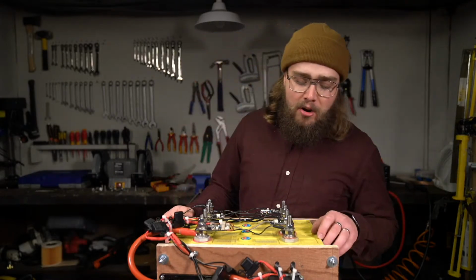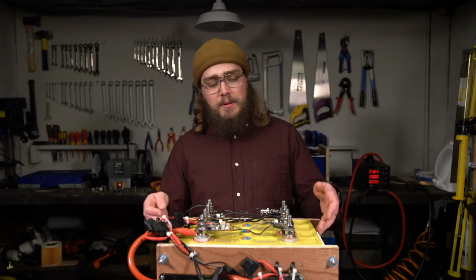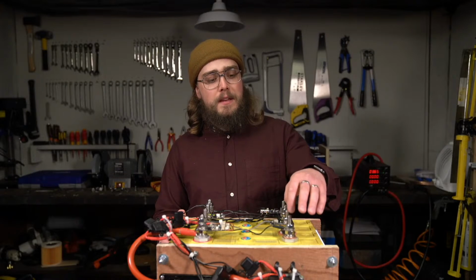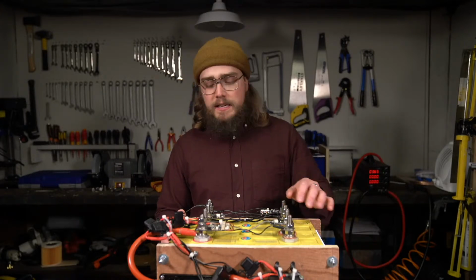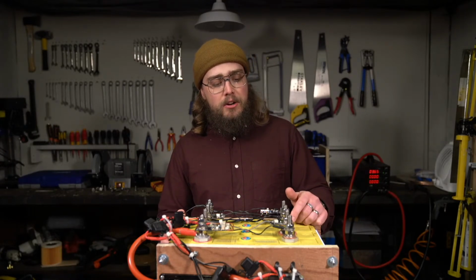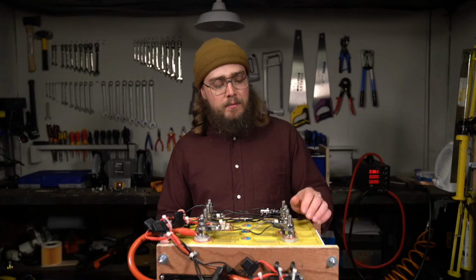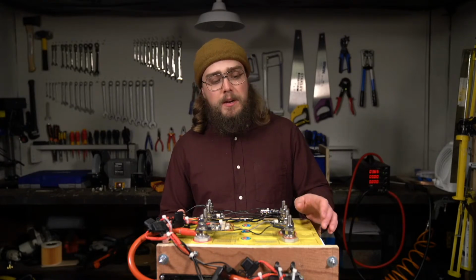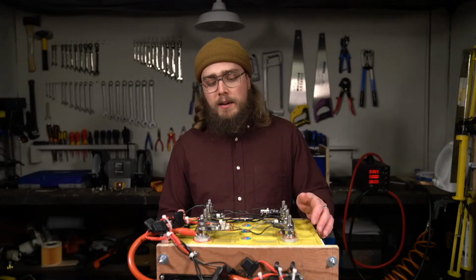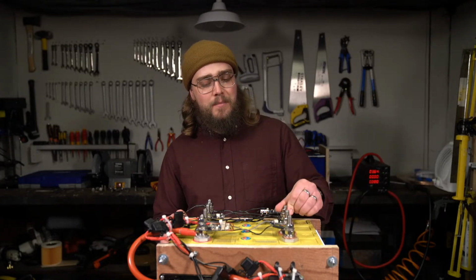Overall, I do like this setup in the sense of how functionally rich it is. The cells are very impressive. As I mentioned in the live over the weekend, the fact that it has M12 studs is really nice, because you can really torque these things and get a good contact. You're not that worried about stripping the threads. Obviously you're not going overboard, but if you're stripping an M12 hole, even in aluminium, you're probably over tightening it. You can tighten these nicely, which I really like.